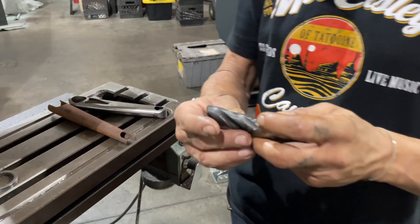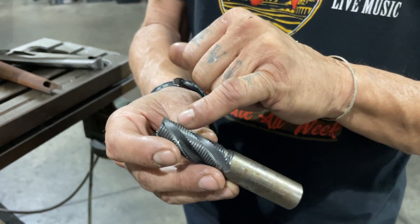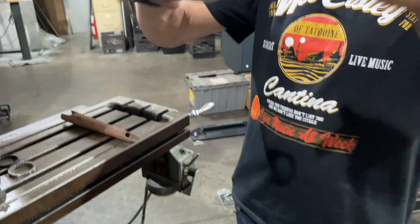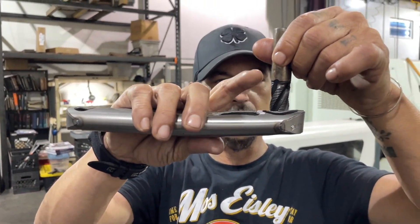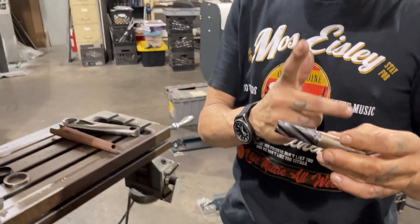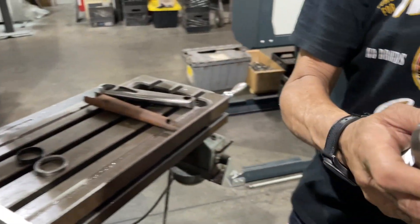As it wears, the edges of the teeth will start to wear and start to get chips, so they don't work as well anymore. But seeing as there's still a lot of end mill left that never gets used, we actually cut them off and shorten them, like this.